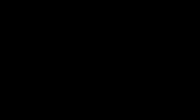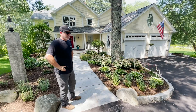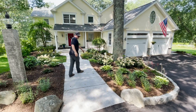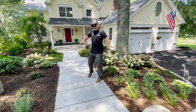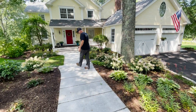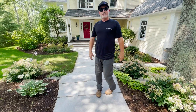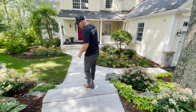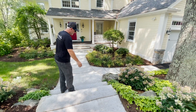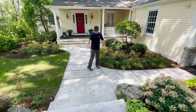Back in Lincoln showing you the finish of this project — a lot of large format granite on this one. Nice big entry stone, a nice way to give an entry into the space, and then we went with smaller planking of granite down. You can see in the jointing we cobbled the edge to give it a more rustic look, and we also used some flowing joint lines in amongst the linear joints, which is a really nice way to break up some of that linear feel.